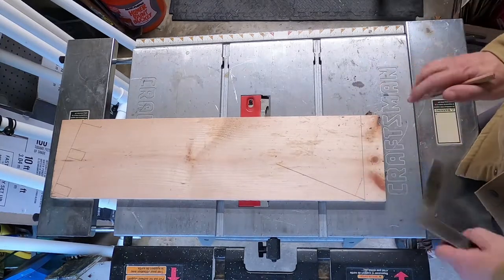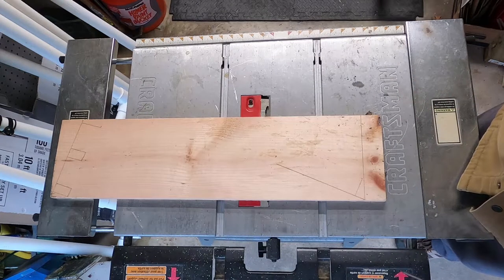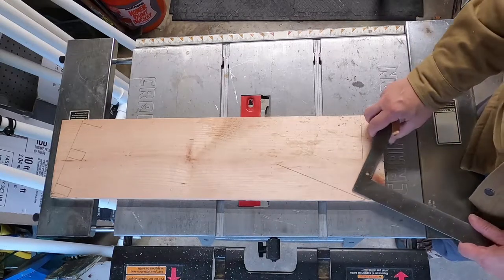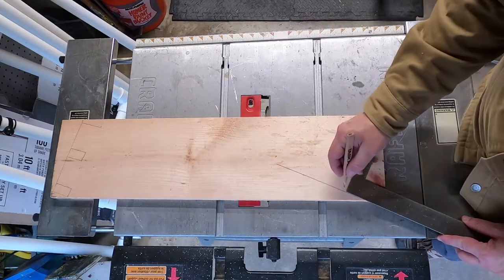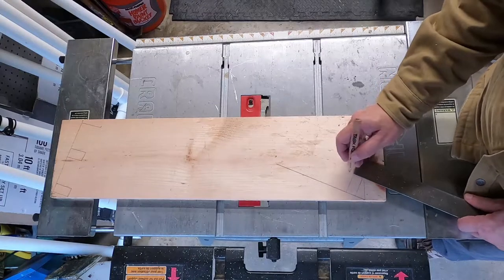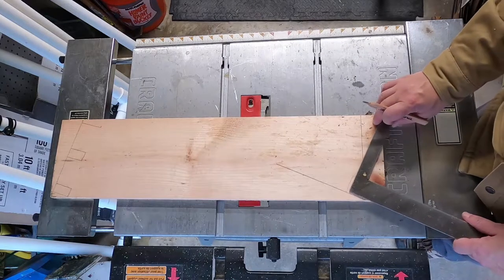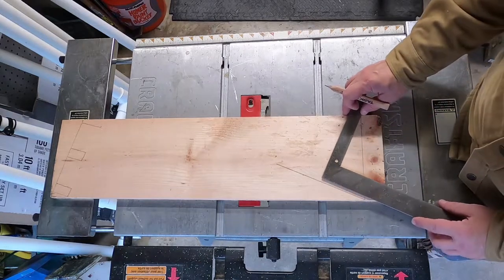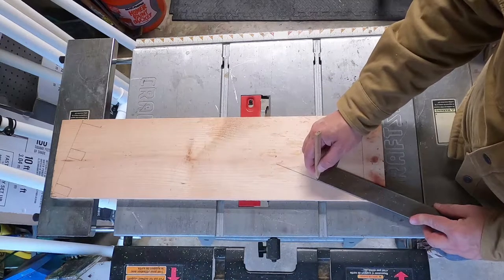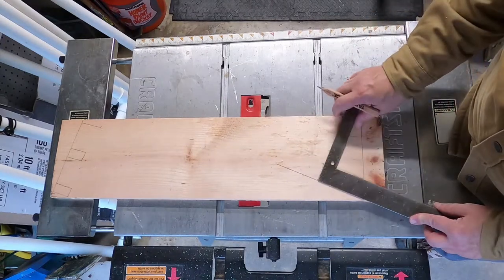Now the wood I'm going to be using is 3/4. It's actually pine 1x6, but you know, it's never quite what they say, so it's basically 3/4. So I'm gonna measure 3/4 for the thickness of the wood, and over 1.5 inches for the depth. And that will be my first shelf. Okay, so now I'm gonna measure up 2.5, because that is the height I used for the existing shelves, and actually works pretty well. So there we go.